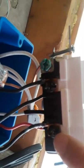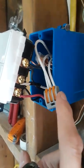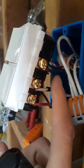Over here we have our other box. This is our black screw, and this is our black wire that runs up from the ceiling fan-light combination. Then we have a black screw up here. See how it doesn't have that fin? I removed that because this has its own separate power, and this goes to our porch. Over here, these are our white wires — these are our neutrals. Here we have our red wire, a white wire that I marked with black, and then a black wire that runs to my porch.